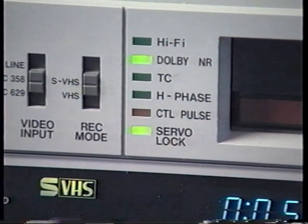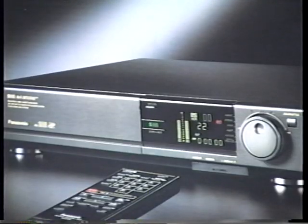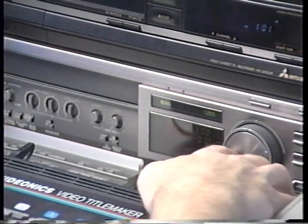The higher end VCRs will lock up their horizontal phasing during a long enough pre-roll. However, the prosumer level VCRs may require the redoing of an edit point several times until the edit takes place off of the frame or field.